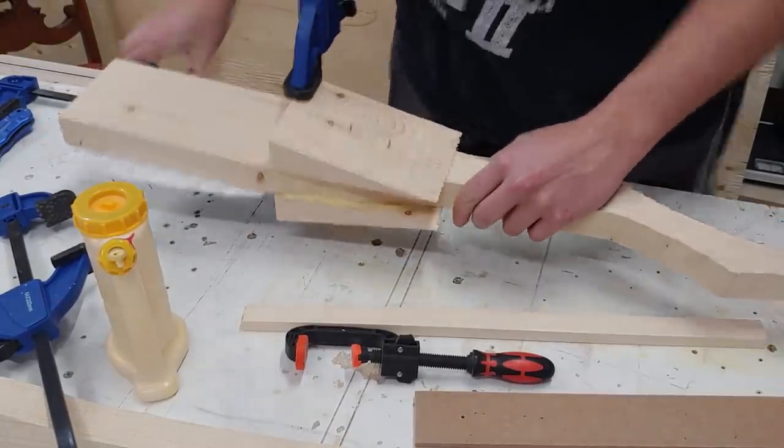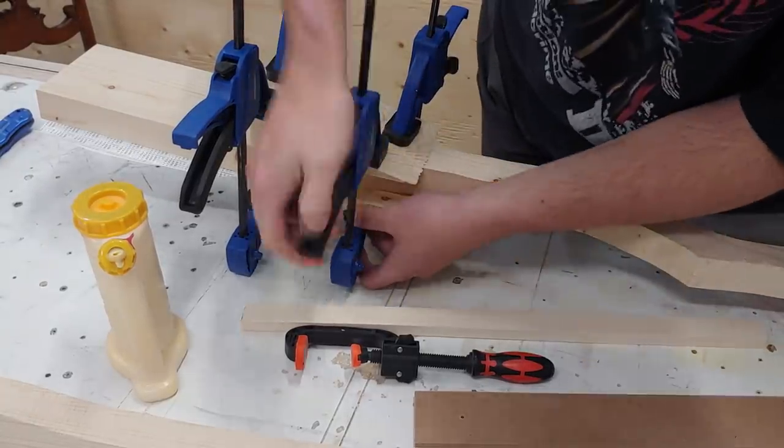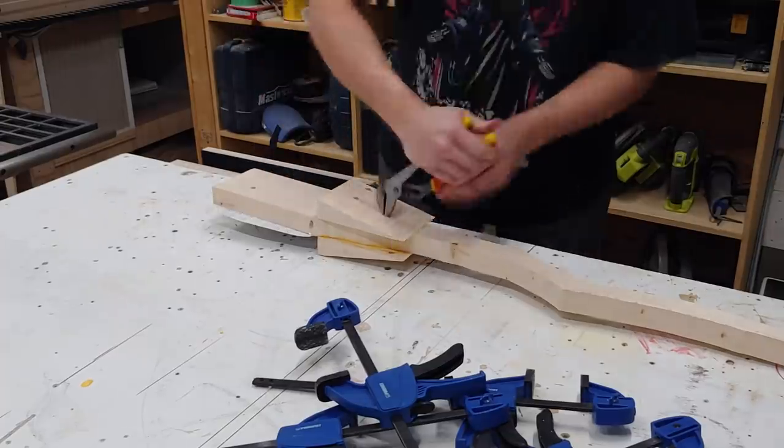As you can see, I used a piece of quarter-inch hardboard to space up the nail gun as it shot in the nails. This will allow me a good surface to grab on with some channel locks later to pull these nails out, as I don't want to be cutting through these nails repeatedly as I'm carving this piece up.